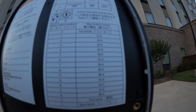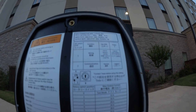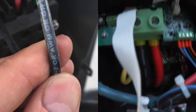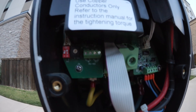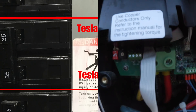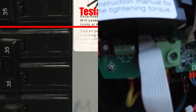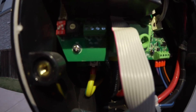They were too careless to put the right dial setting on when they wired it up. There's a 10 AWG wire size, rated up to 30A, which they installed on the back side. And then they didn't even set the right dial. So I need to switch the dial. Make sure that you have a 35A breaker, or a corresponding breaker with the corresponding wiring, and then you can switch that dial. That's what I'm going to do now — let me shift some more light to it. I've now twisted the dial.